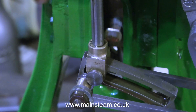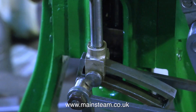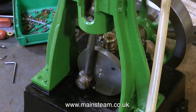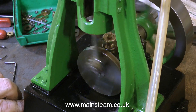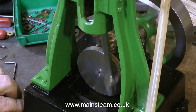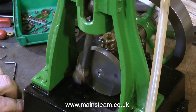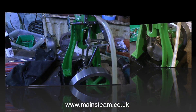I'm not really surprised, because the drop arm is to the correct dimensions to fit the engine — not to the drawing, but it fits the engine's dimensions. So now I can give the engine a test run, and guess what? It sounds like a pneumatic drill. There are two things wrong: the flywheel is slipping round on the crankshaft, and also the crankweb, which is fixed in place, is not fixed securely enough, because the valve events are very premature. The valve opens far too soon, it's giving real hammer blows, and it's actually loosening the crankweb.